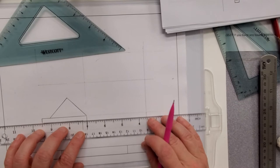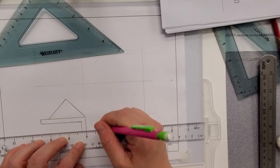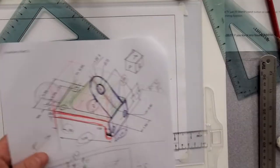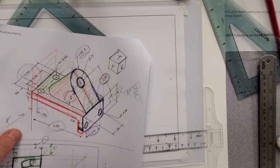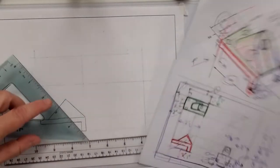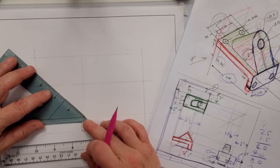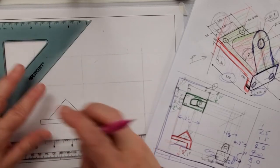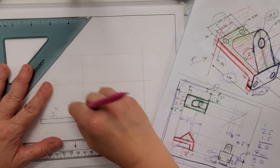Yes. I'm sorry, I just kind of got lost on the part where you were talking about how to find the length of that triangle and everything. The length of this triangle is the 2 inches plus the 1 inch radius. So it's 3 inches, but half scale is 1.5 inches. Right. So I did that part. The other side? Yeah, the other side. Well, when you draw this line, let me erase it, because I'm good at erasing things now.